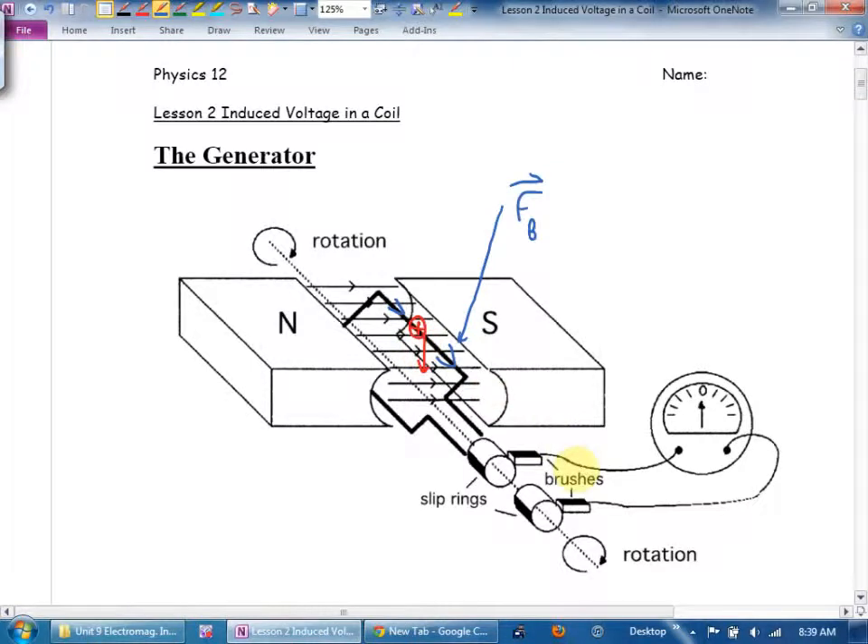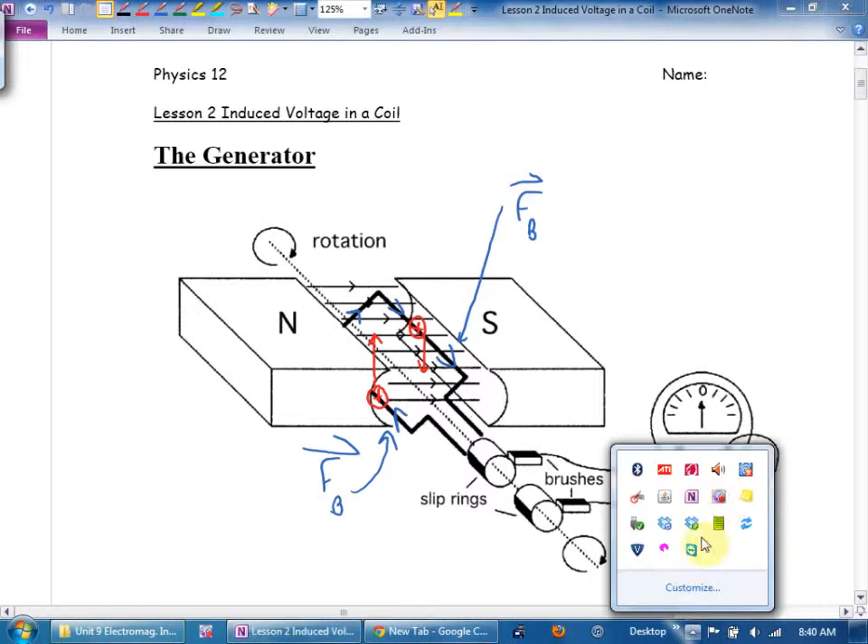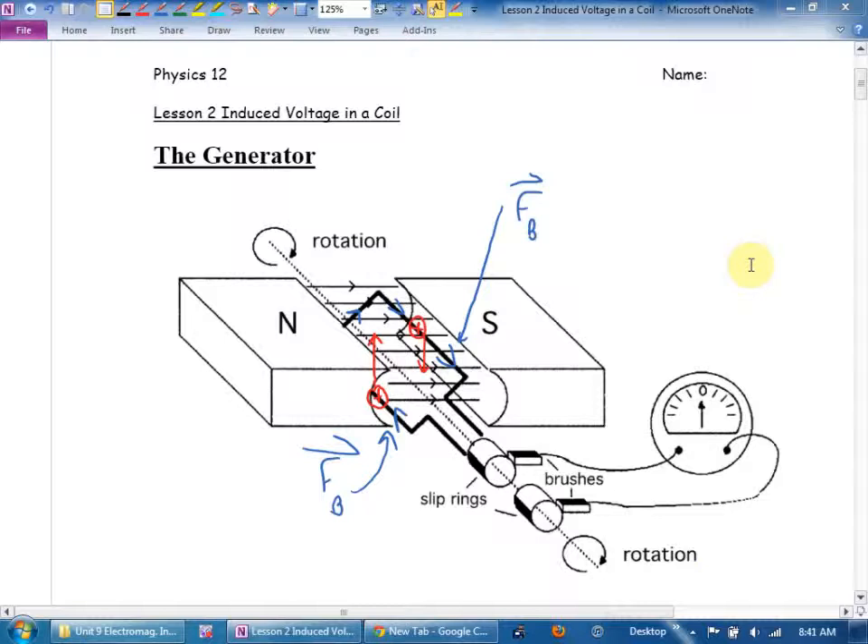In this three-dimensional drawing that's down and to the right. We're going to look at one more positive charge on the other side. As this spins, which way is this positive charge moving? Up. So if you point your thumbs up and the magnetic field is to the right, this particular charge would experience a force in the opposite direction — out the other side. In this particular situation you would get a current like this: charges forced up on the left, forced down on the right. We've got a current, we've got a generator.